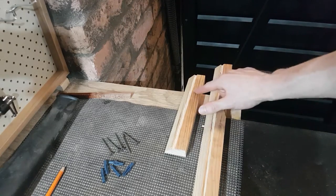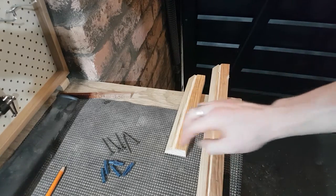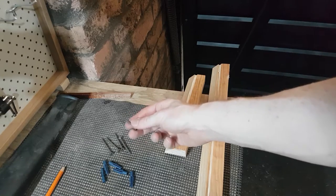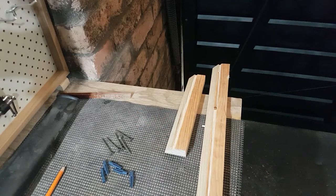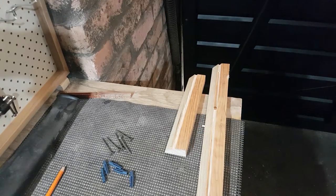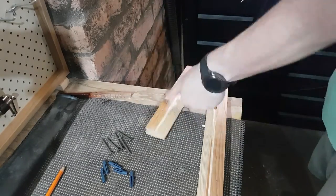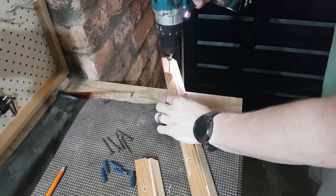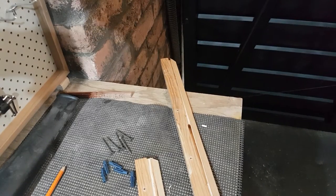These aren't going to take a lot of weight — I've just got two holes in the small one and three holes in the big one. I pulled out some plugs and the last long screws I could find. They're not ideal — they're pine screws — but they'll hold up the weight they've been asked to do. I drilled a few holes; those were the easy holes.